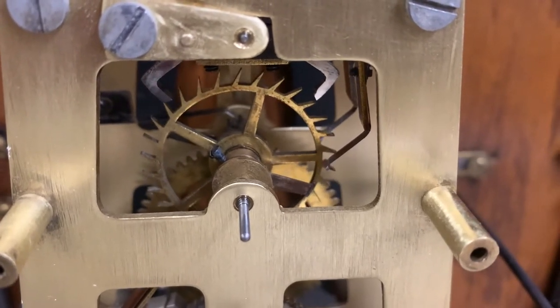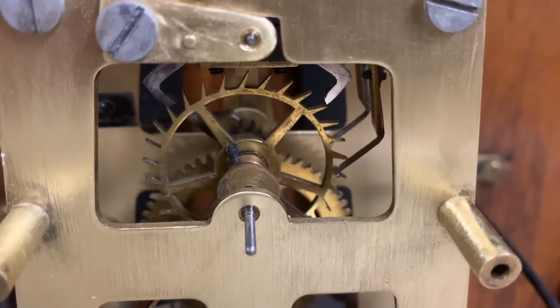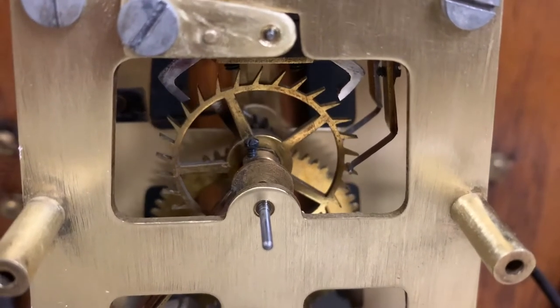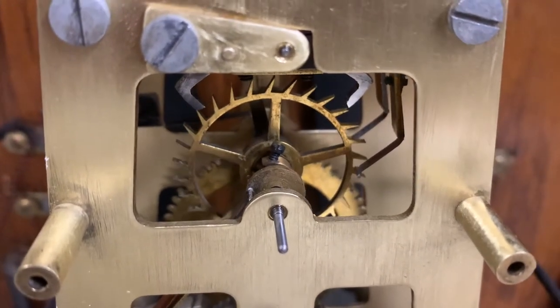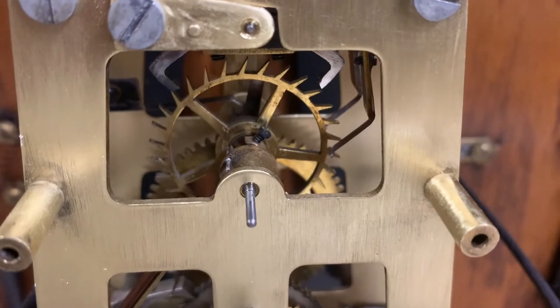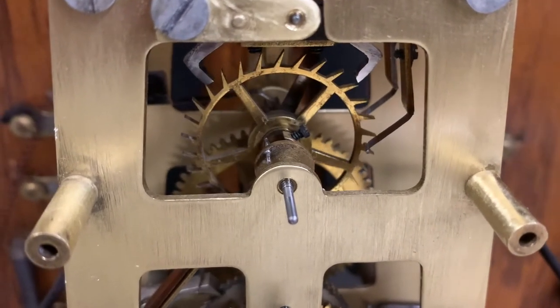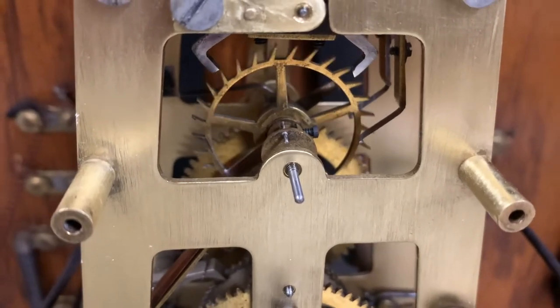You can see that the wiper passes under the contact, hits the contact, and then passes over it. You can see the screw coming up at about 12 o'clock right now. I ended up having to adjust that slightly, due to maybe a slightly different position in the gear train than it originally was — that adjustment was very helpful.